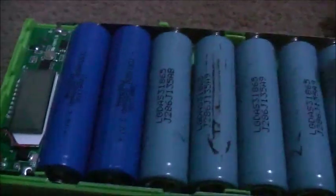And they've got this power bank kit arrived. How good's that? Also got the circuit boards for these batteries arrived. They go on the ends, protection circuit boards. So now I'm going to come up with a clever way to hack one of those into that little light. I haven't got any proper heat shrink that's thin to get around this whole cell. So I might try soldering one onto here. Put the board on here, but it's going to run along here with thin wire. And I need another washer to go on here to cover and protect everything against shorts.